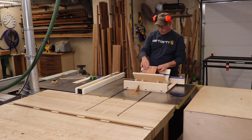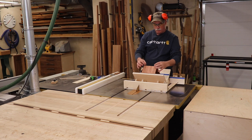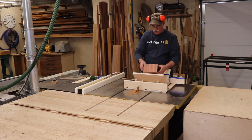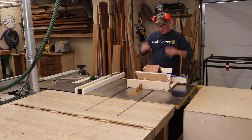With the box out of clamps, I've set up a stop block so that I stay consistent all the way around. I'm going to do two smaller ones on the top and the bottom, and I'll just flip these and use the same stop block setup. Then I will center and make a little deeper one in the middle, so there will be three splines on each side.